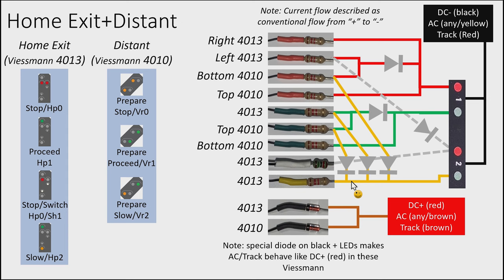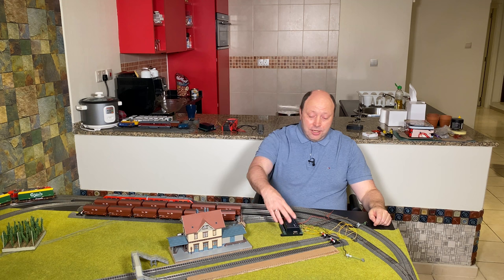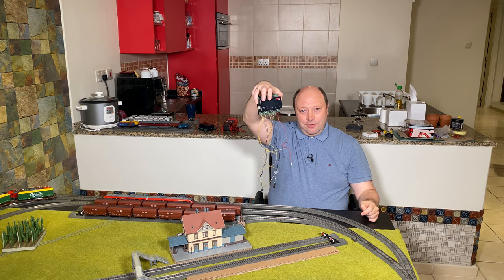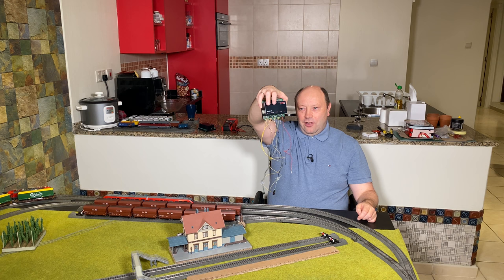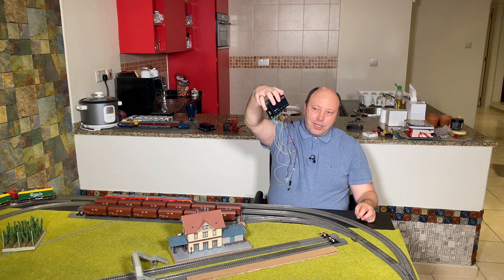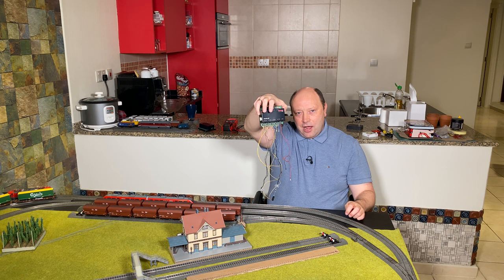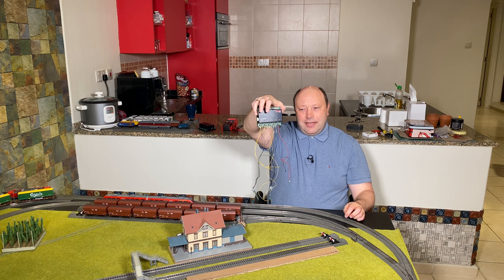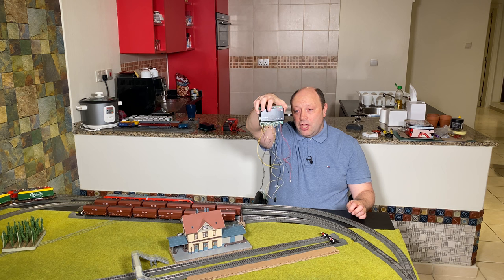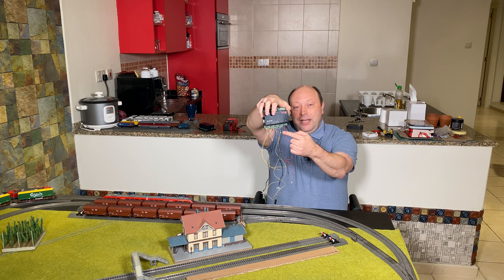Connecting an M84 to two signals requires a lot of wires, some soldering, and some diodes — though diodes are not expensive and are quite sturdy. Please do not end up with an exposed wire mess like this temporary setup. If you need a permanent installation, insulate everything properly and keep the wiring organized, otherwise you will never figure it out again underneath your layout.